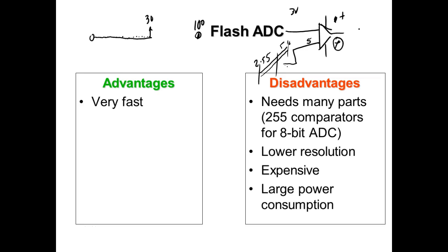So this is what a successive approximation does. Instead of ramping here, right, you understand, what does it do? It starts in the middle and then bounces back and forth until it finds it. Is the reason you do that because of speed? It's faster. Speed, yeah. It's not as fast as a flash converter, but this is the second fastest available. Well, you know you don't have to start at zero. Yeah. Odds are if you're measuring something, it's not going to start at zero.